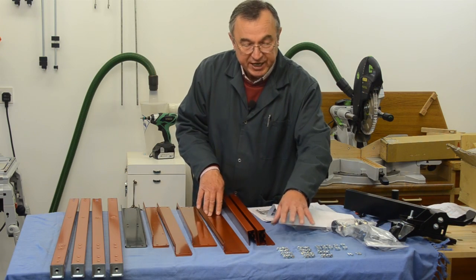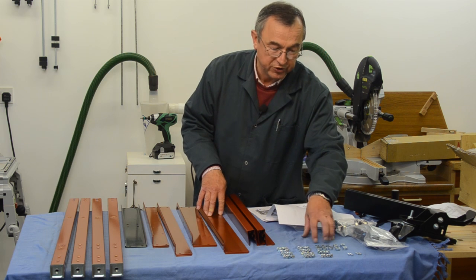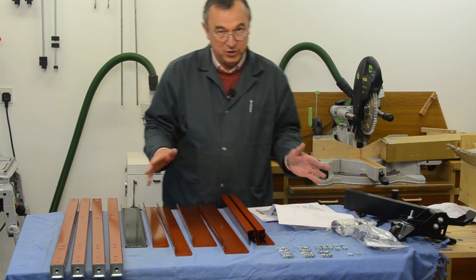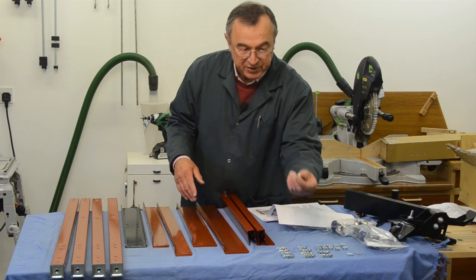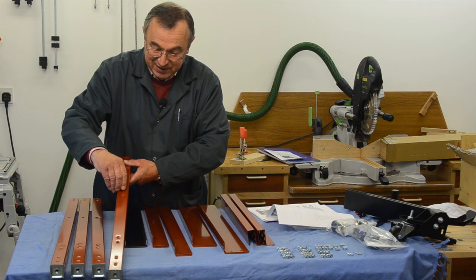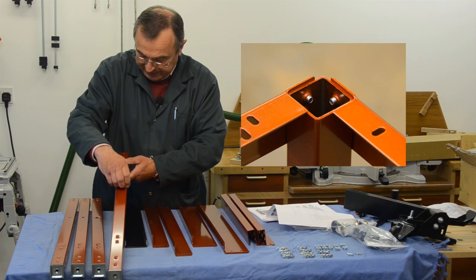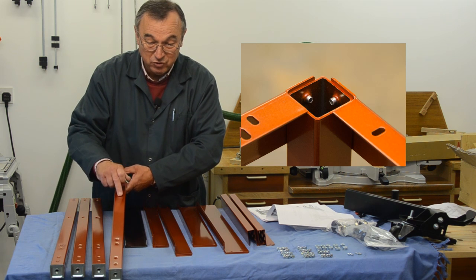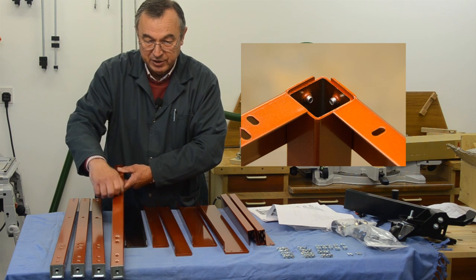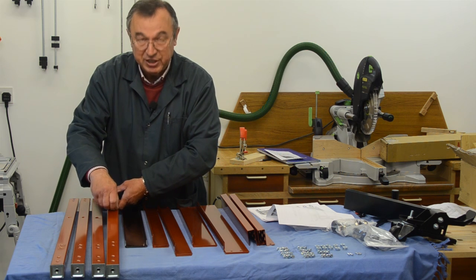I always like to check the fixings, and in this case all of them are here. There are 40 M6 bolts, 40 washers that go with those bolts, and a couple of small screws and some nuts. My first concern was where are all the nuts for these screws, but then I realized these legs have threaded holes in them already. As that is the case, you should not over-tighten these because it's only the thickness of the steel — don't get your very best socket set out. Just tighten them until they're nicely nipped.